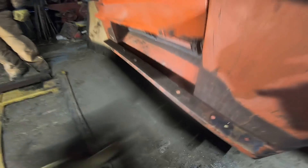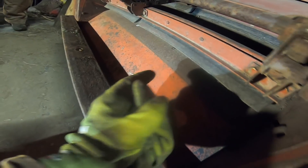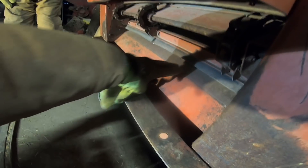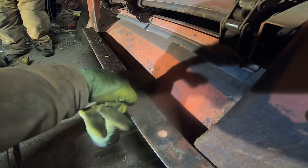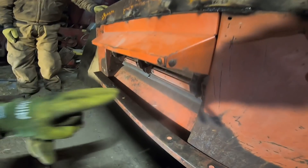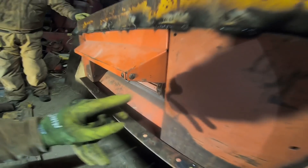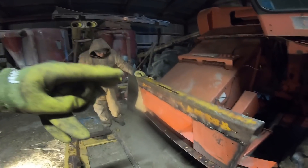You can tell this angle is higher than the metal here based on the high amount of paint still left — and the brown, which was shiny before this sat in the barn for a long time before I got it. Obviously corn didn't hit there. Right about where my finger is, there's a big change of angle on this bottom plate. The newer corn heads had a piece of sheet metal to fill that, coming out the back of the corn head, to expand that gap so the corn wasn't coming up this steep rise. That's why we're raising it up 6 inches, so as we come out of the corn head it's a more level, if not possibly downhill, approach.